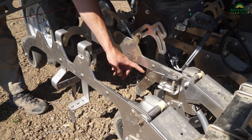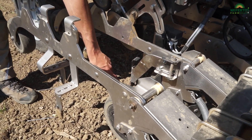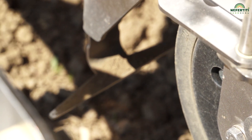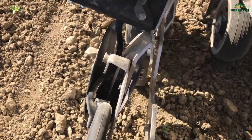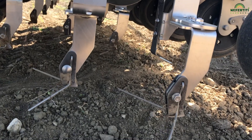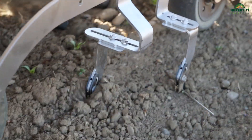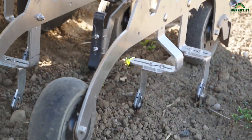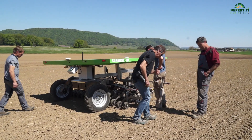This hoeing arm here is a fascinating component. It has a little motor that allows it to move back and forth. You can see the little hoe share here, which is moved into the row. But of course this happens below the soil surface and is not visible when the robot is at work. Between the hoes you can see these triangular wires. They cultivate the entire area between the rows. We adjusted them to move approximately one centimetre below the soil surface, where they undercut the germinating weeds, resulting in a largely weed-free field.